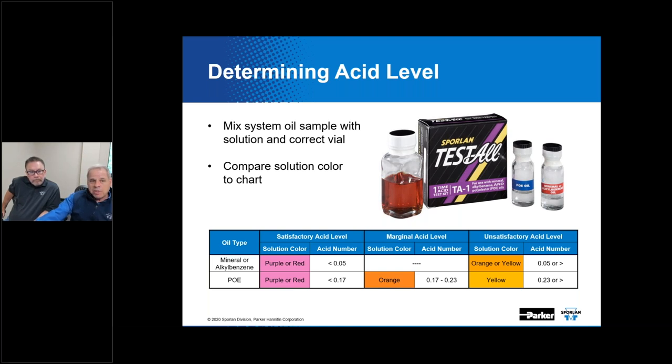We will sometimes receive contaminant controls, a filter dryer, if you will, and the complaint will be that it has excessive pressure drop across it after it's been installed in a system. What would excessive pressure drop across the filter dryer indicate to you, Kevin? That it's working. It's actually collecting contaminants that are in the system, and that's what you want it to do if they're present. It's done its job.